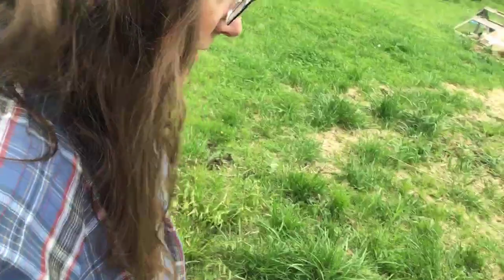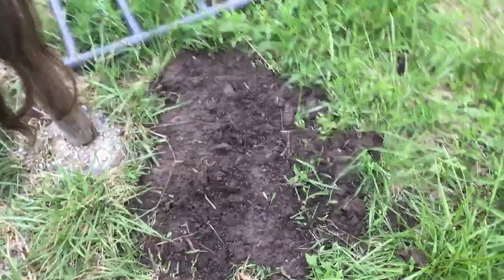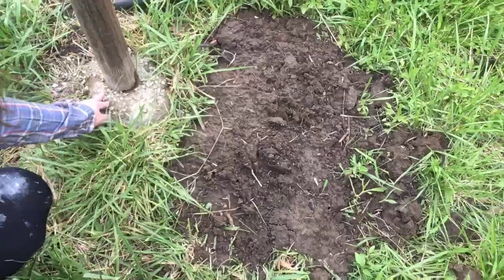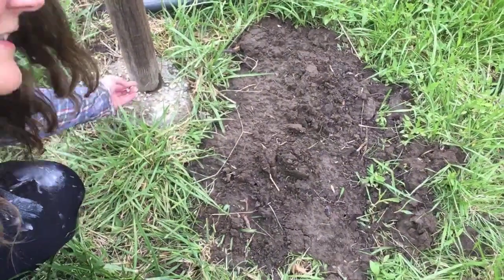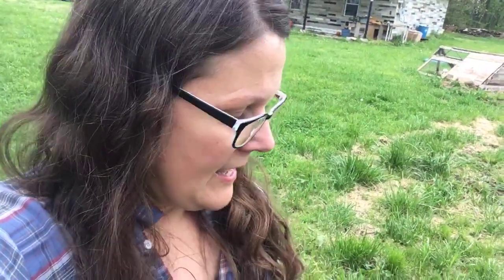The next video will talk about getting rid of the groundhogs so an animal doesn't step in their six-inch wide hole and break a leg. This one is nice and dry — you can see the rocks on top from the concrete mixture already, but the posts are in there tight. We're saving money — we talk about being frugal farmers. We're using the posts that were already on the land, and the concrete wasn't that much. It's about two thirds of a bag per post if you're doing a two-foot hole, and we're doing a two-foot hole.